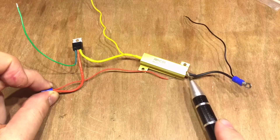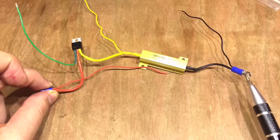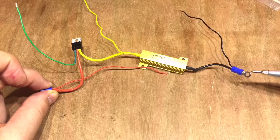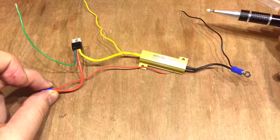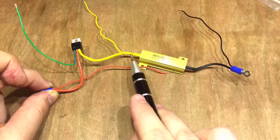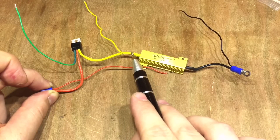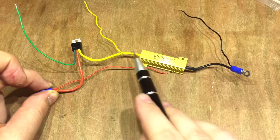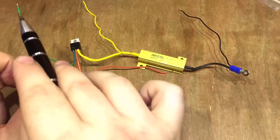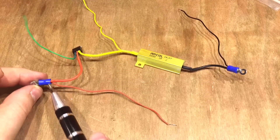The green wire is for the gate of that MOSFET. The source of the MOSFET goes through this resistor — the correct one-ohm resistor — back down to negative. We've got the black wire to make sure the Arduino and the DC power supply share the same ground. The yellow cable tests the voltage at this point, and because this is a one-ohm resistor, that voltage is equivalent to the current passing over it.